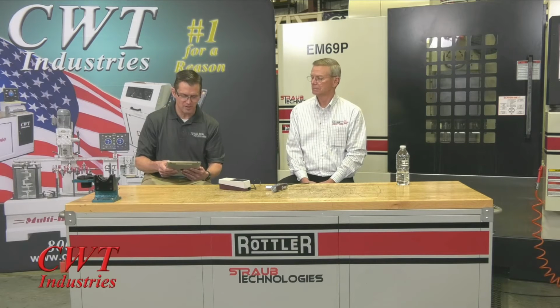Let's do it. So, number one question is, do you often get different surface finish values after honing several liners from the same series, even when you're using the same honing procedure? I would say absolutely, and I think you will agree with me there, because each cylinder liner isn't the same hardness. The material varies, and so you'll get some cylinders that are harder than another. Even in a standard V8 block, doesn't have to be a liner, one end of the block could be harder than the other end of the block. Well, because it's a cast material.